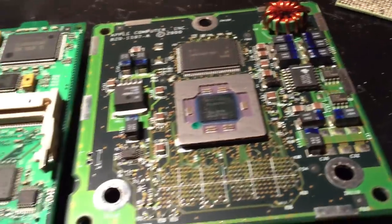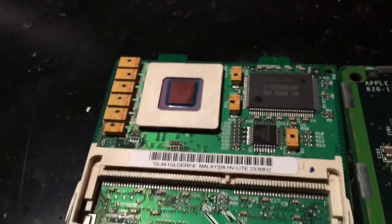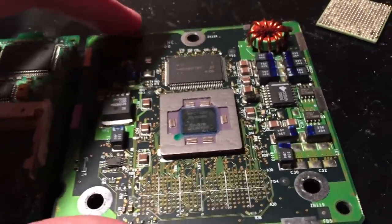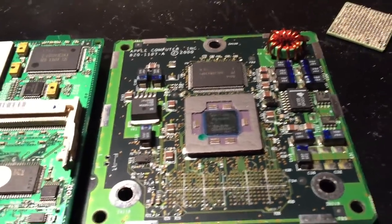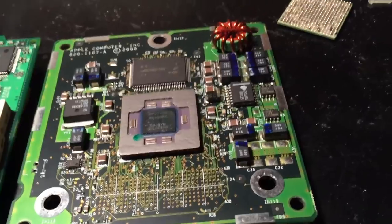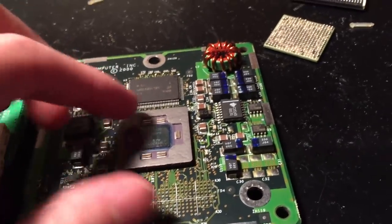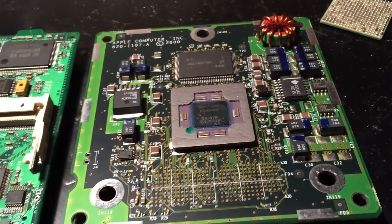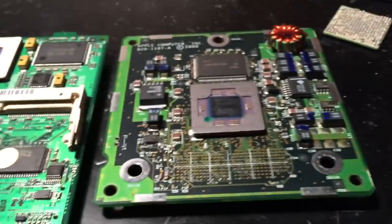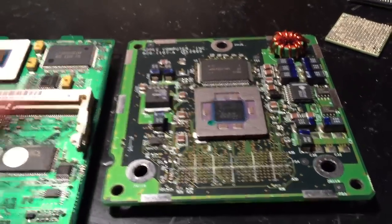Here is our target G4 CPU that we're going to be soldering onto this board. The first thing we need to do is desolder it off of its current board and re-ball it. I've already shown this process in a previous video — the G4 upgrade on a PowerBook G3 Pismo — so I won't film it again. Essentially, we'll desolder the CPU, remove all residual solder, and solder on new solder balls using a BGA stencil. Then we'll be ready to solder the chip onto this board. I will show the process of removing the original CPU from the iMac card.